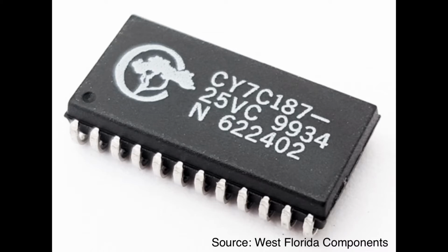You can imagine waffle making. You spray oil first before pouring flour mixture into the waffle iron. It makes it easy to take out the waffle from the waffle iron. Same thing for the molding process. But this oily material on package surface prevents ink from adhering well to the package. So, it is necessary to remove it before ink marking.